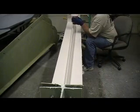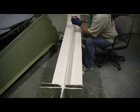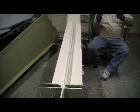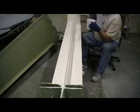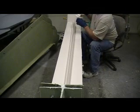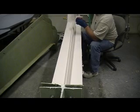I also found that if I leave a little bit in this cup, what I'll do is pour a little bit into my Dixie cup — not very much — and let it set for about 30 minutes. If you've got the mix ratio right, it won't get all foamy and hard. I'll pour it in a Dixie cup, just enough to get these edges. This epoxy will set about 30 minutes in the cup and get a lot stiffer. Two light coats just ain't very much on these vertical surfaces.